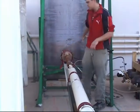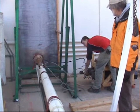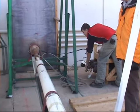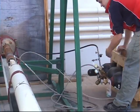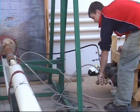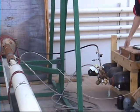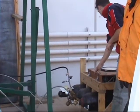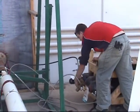Since there are two chambers here, what we do is pressurize the back chamber to 150 psi. We open this up, and once that's set to go, we leave this open and pressurize the front chamber as well — the front chamber we pressurize to 320 psi. Once it gets there, we close this back up.